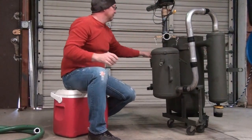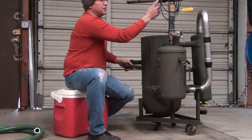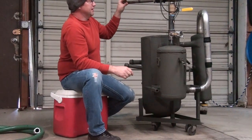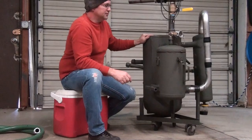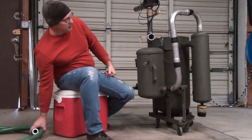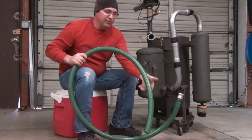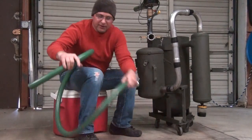At the top, all I have is a piece of rubber from Lowe's plumbing section - two inch - hooked to my fan and to an exhaust piece. This is mainly just to get the gases going, light it, and make sure I have gas before I hook it to my generator. I say generator, but I've hooked it to a wood splitter, a power washer, a number of things - they all run fine. The plumbing itself is inch-and-a-quarter cam lock that simply goes in here, clamps on, and runs to a hole I cut in my generator breather. Stick it in there and the generator runs fine.